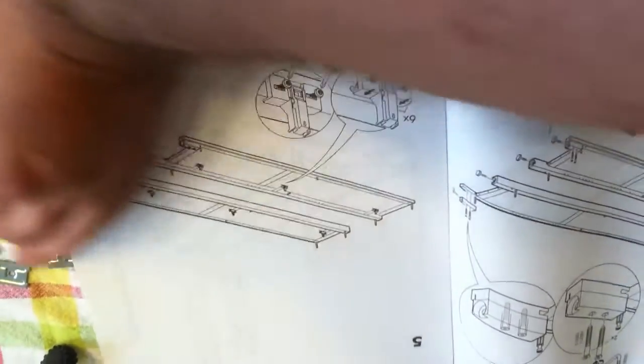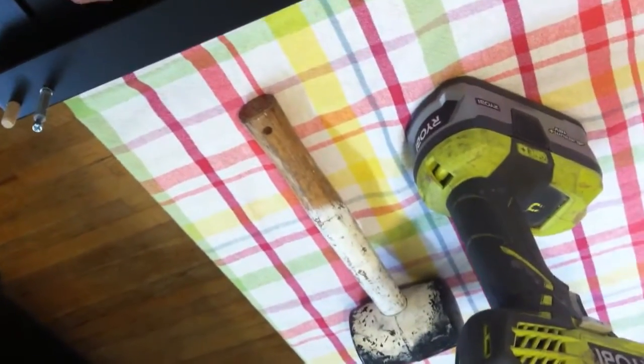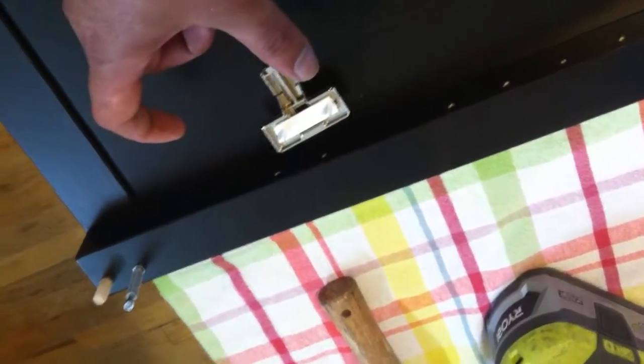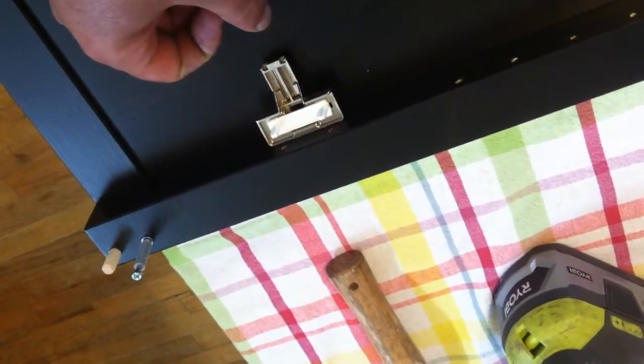So these are the little hinge bases, and on the next page up we see where the positioning is, which is when we have two holes together. Okay, so you'll see there we've got two holes together. There we have two holes together. We have that group of 4 or 5 holes. That's where shelves go. Now, these have a little plastic base where it's adjustable a little bit up and down, but when they come from the factory, they center it. And your best bet when you go to put this together is just put it together centered. That's the way I'd recommend doing it.